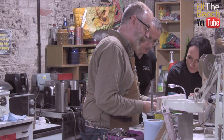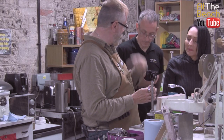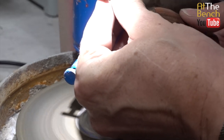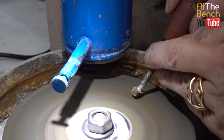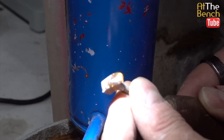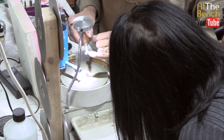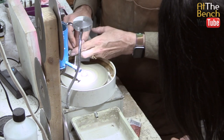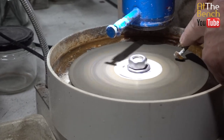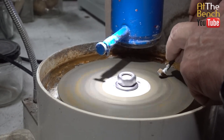The other way you can work stones is with a lap that is not flat but a wheel - it has a band all the way around, which a lot of people who do cab gems use. I have this flat one because it allows me to both facet and cab. It doesn't look like there's a colour bar in there, but we'll carry on and see. It's kind of interesting - the colours in there. I know I'm colour blind, but I think there's a tiny bit of blue, a little blue stripe. I can see blue - looks like there's a colour bar in there, so I'd like to get down to it. It doesn't look like it's a very thick bar, but let's see if we can get in there. It's exciting, isn't it? Because you don't know what you're going to reveal.